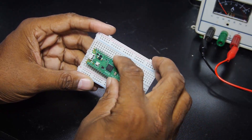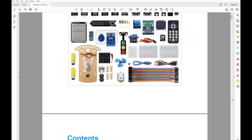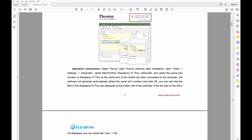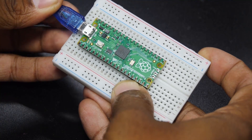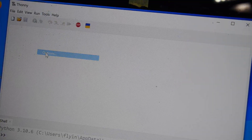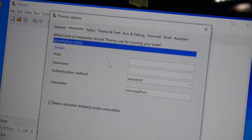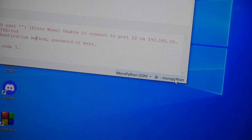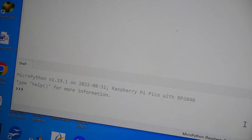The kit has several small breadboards which the Pico easily snaps into. Before starting, you'll need to download the manual in PDF form, which has a list of experiments, pinout diagrams, and programming software installation instructions. All programming is done through the included USB cable. After installing the Thonny programming software, you'll need to configure the interpreter and select the correct COM port in the bottom right of the screen to see a shell prompt.